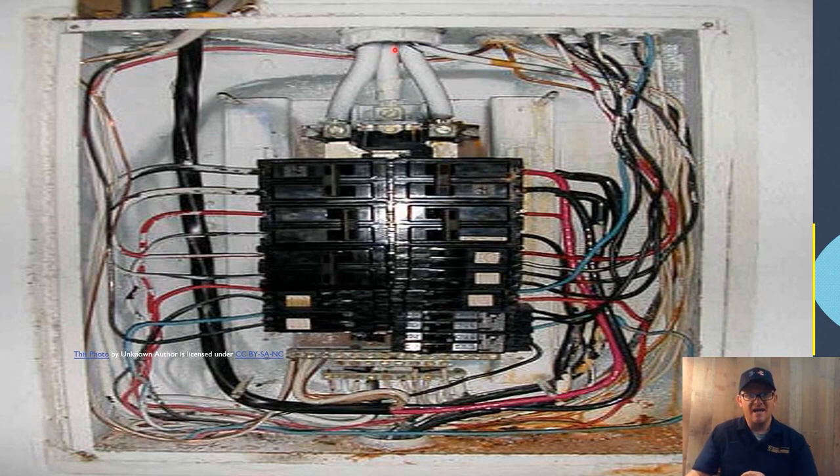Another way that water can get inside your home is through a leak in the meter can outside or in the connection behind the meter. The meter is going to sit against your house — and by meter I mean meter socket or the outdoor electrical disconnect. You're going to have a pipe likely penetrating the house at some point, or it may drop down beneath your meter and pop into the house. Water can literally ride in on that pipe and ride straight into your electrical service — it doesn't even have to be on the inside of the pipe, it can ride on the outside. Water can collect outside, gravity wins, it flows down and flows inside your house. Water can also be collecting inside the pipe in the meter, coming down, riding down those conductors straight in. Sometimes it can be riding in from your weatherhead, rides straight down those conductors and into your home.